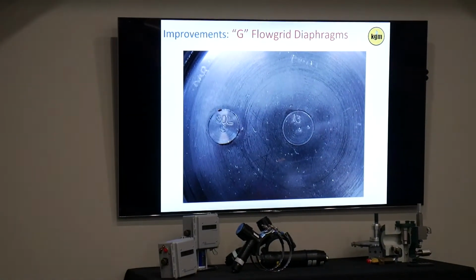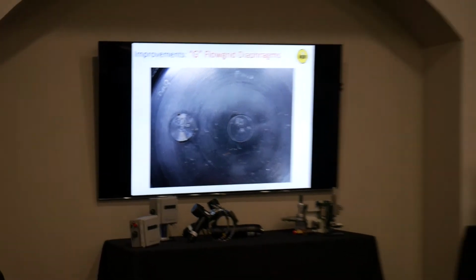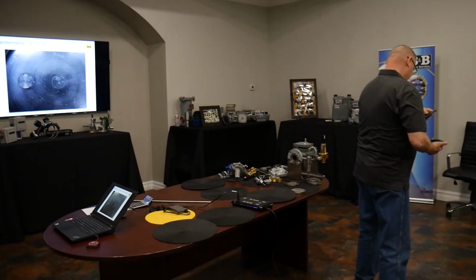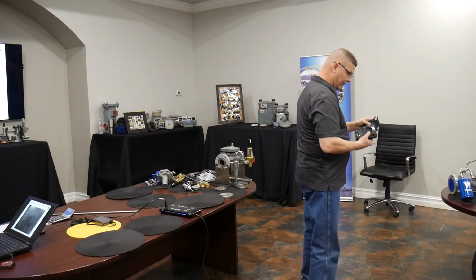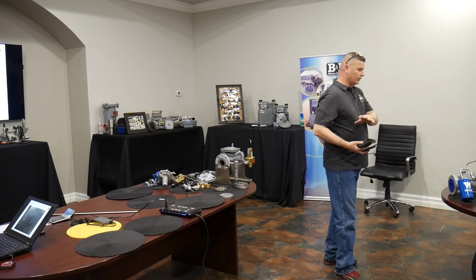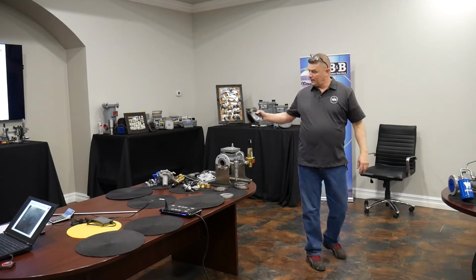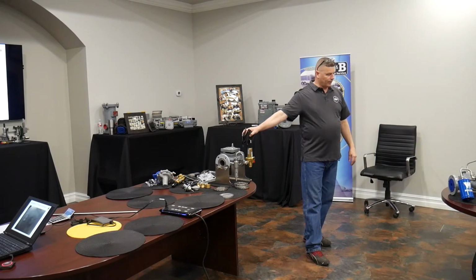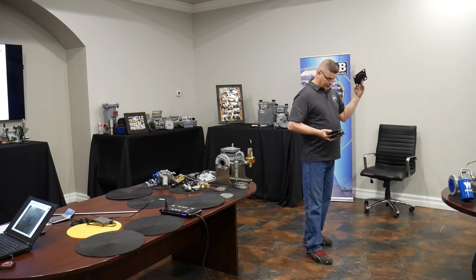So these are the offerings of the diaphragms. This one is 75N, so it's nitrile 75 durometer. Good from the 60-pound cut, where we said the 60 duros live, up to maximum differential, which in a 2-inch body or larger was 800 pounds under normal conditions, okay? 1,200 under non-standard conditions. There's also a Viton option in 75 Duro.